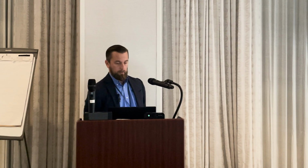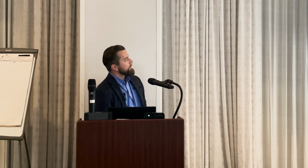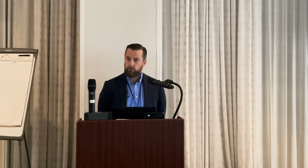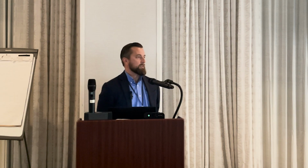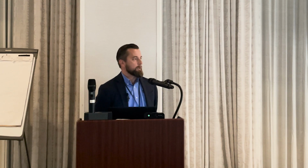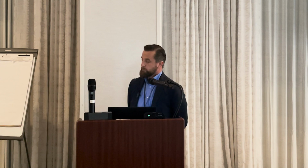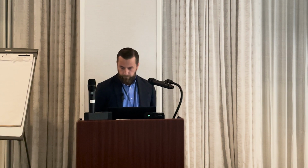So if you see a part that's failed and you see shininess, I don't know if you can see it very well, but there's a little bit of a sheen to that. The inside of that bell right there is difficult to prepare well. So it might be prepared, or should be prepared, before it even gets to site and taped up. If you just take the tape off and try to join it up, you're going to have that issue right there. You need to scuff it up again. There's special tooling to scuff it up to get a good profile so you can bond to that, to increase the surface area and get the adhesive to bite.